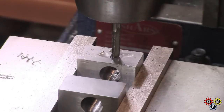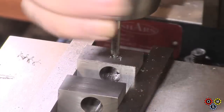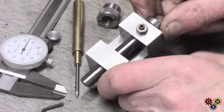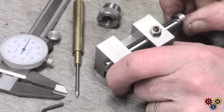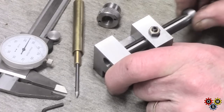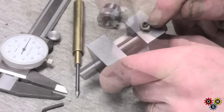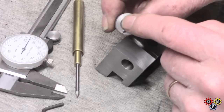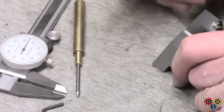Tapping 2BA for a set screw — that was just very convenient, so I went with that thread. It does the job alright, and then we modified the set screw later. Now we've got the set screw in place — slightly larger nut than I wanted, but that's all I had. So that's tracking pretty good in the slot in the rod — very, very slight movement there, but it's not enough to matter. So it's running pretty good, and that was machined at the end to suit the slot. And then the vernier itself — we've got two holes, only one of which I'm going to use, but we'll have some fun and games getting the spring and the ball in. That'll probably be an awkward job — we'll probably lose one or the other part.